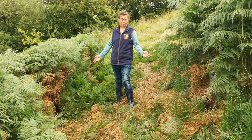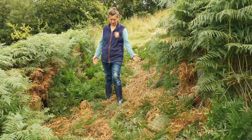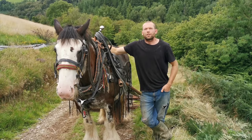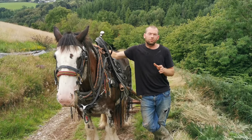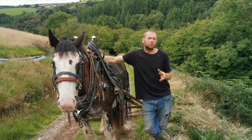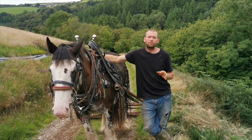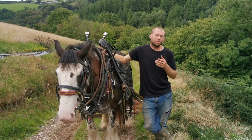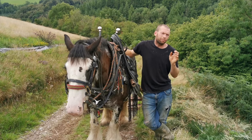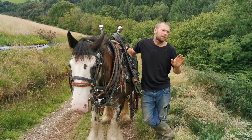This is just to demonstrate what the bracken roller can do — this is the first pass that we did yesterday and as you can see it's gone from this to this. Cutting bracken once a year is really ineffective. If you are going to cut it you have to do it three or four times because that's how fast this plant will regenerate. But by crimping or bruising the stem it bleeds and bleeds that year and you only have to do it once.